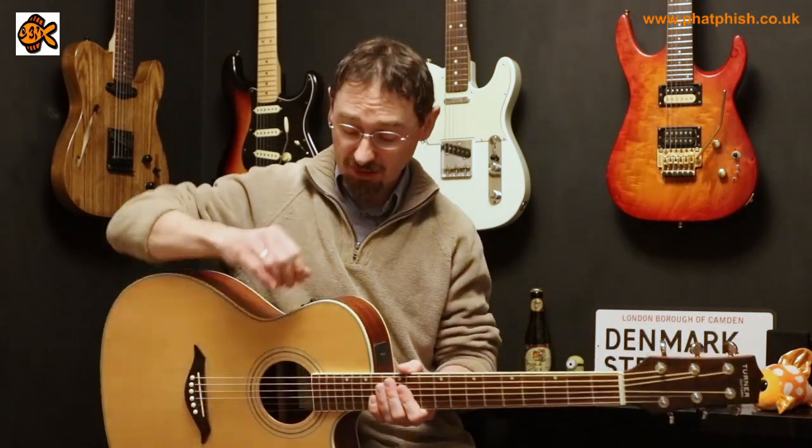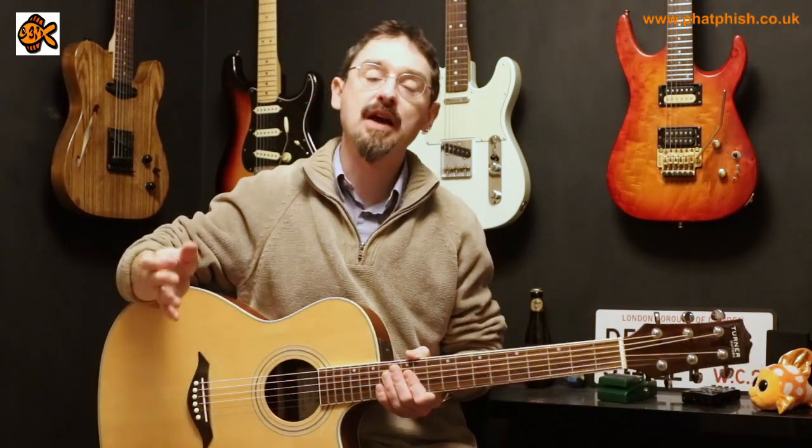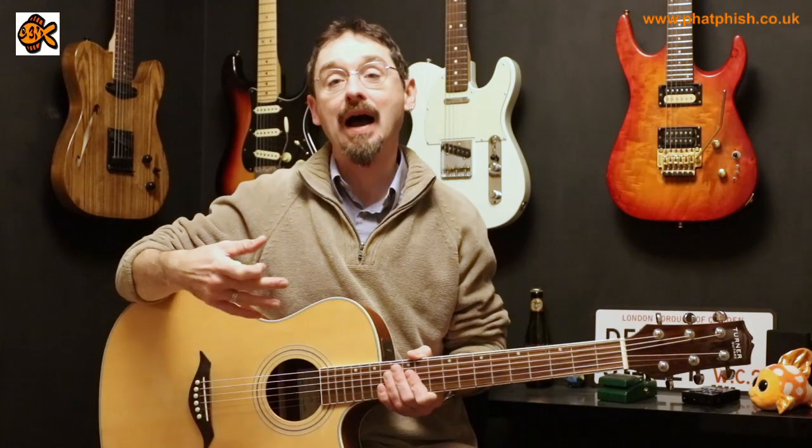Now, if you're familiar with electric guitar, like Jimi Hendrix, all that sort of hard rock stuff, you'll be familiar with the idea of feedback. And this is exactly the same thing that you're hearing. Turn the volume down there. What you're hearing is the sound coming out of the amplifier, hitting the guitar, and the guitar picking that up and so sending the signal back into the amplifier, and you end up with this feedback loop, which is that howling tone that you get.